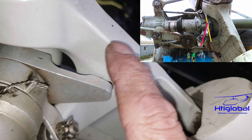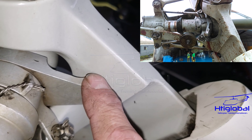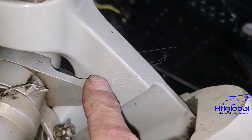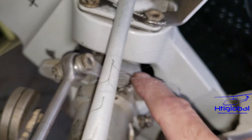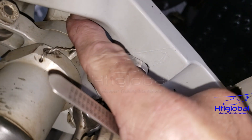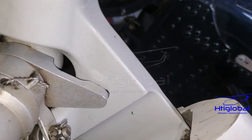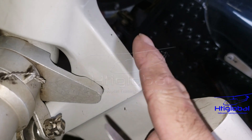When they came out with the AMSB in 1996, they made a mistake — they were telling you that you need to throw away the flapping stop, the yoke, and the trunnion, which is not correct. They corrected it later. Nowadays the only things you're going to be throwing away are the flapping stop and the yoke.